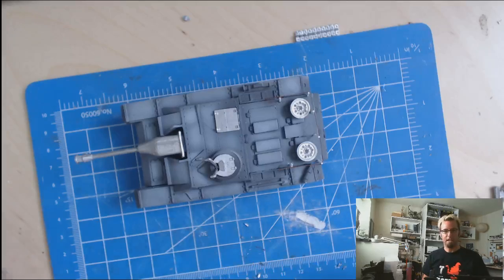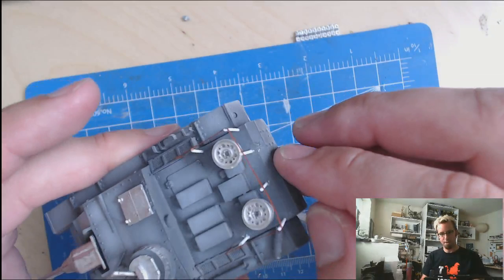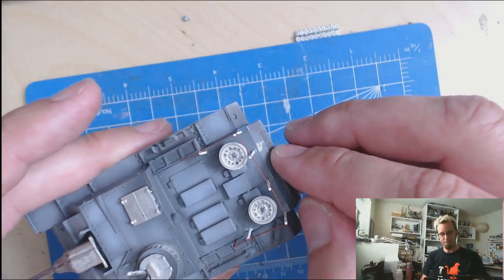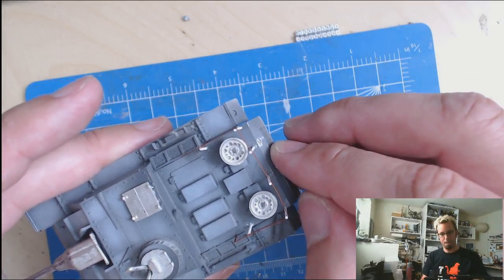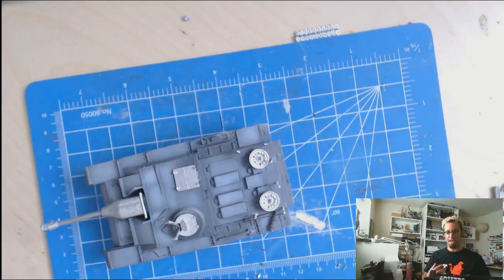Because, yeah, sure enough, if you have glue spots like we have here on the back, try to get the light so it shines. Oh, there you go. Perfect shine right there, right? That's going to show up when you paint. It's going to show up as texture because you've got a texture there that is large enough that you're not going to be able to mask that over simply by painting.